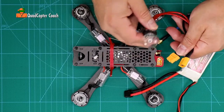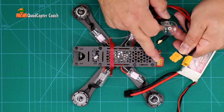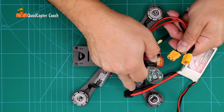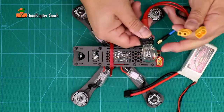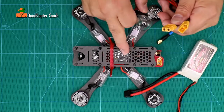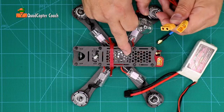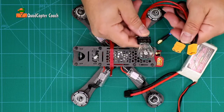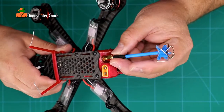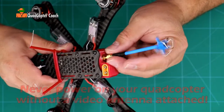The smoke stopper works by plugging in the female end into the XT60 connector on the quadcopter and the male end into the battery connector. If there's a problem, this light bulb will flash and burn out rather than your wonderful electronics that you spent good money on. So this can really save you a lot of aggravation — that's why you need the smoke stopper.